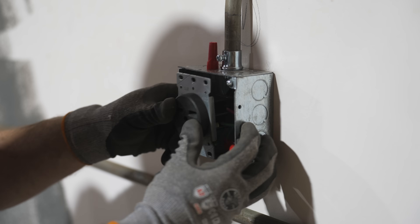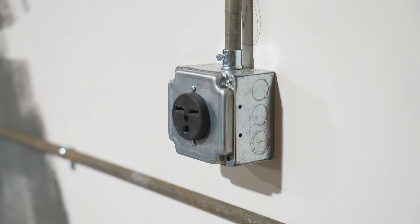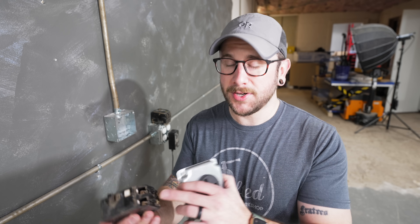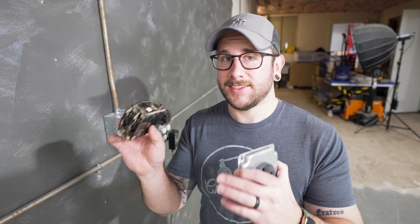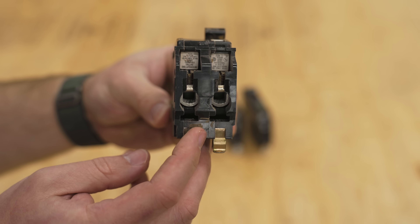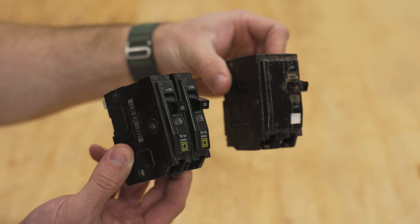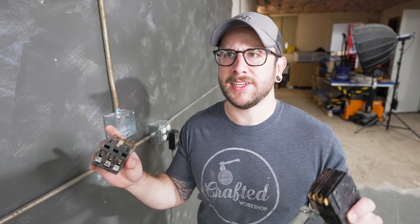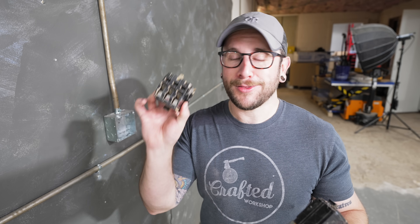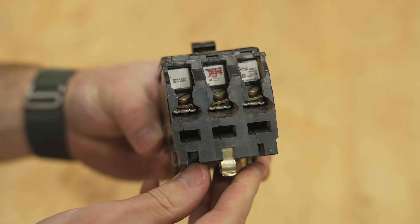I had started trying to use another style of outlet, which is what I had wired up my bandsaw with at the old shop since it only needs 20 amps, but bending stranded wire into a hook is a total pain and I didn't have any ring terminals to crimp on. So I switched over to the straight-in style. Since I ran 10 gauge wire to these boxes, this is a 30 amp rated outlet, so in case I want to bump up my bandsaw at some point I can do that very easily. A 240 volt breaker is just basically two single-pole breakers put together — you've got a spot for two hots, and I just needed to connect the ground wire to the ground bar in the panel.